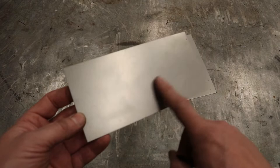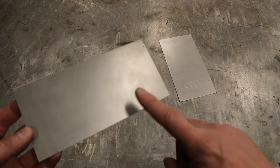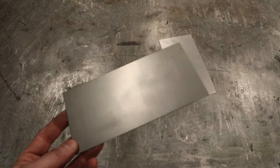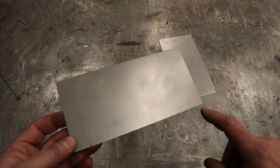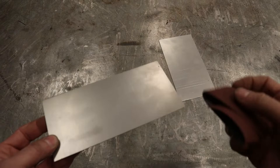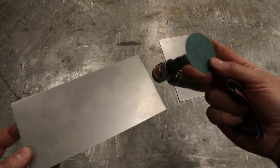The art of taking nice shiny metal and turning it into rusty metal is not an exact science. You're not going to get the perfect shade of color right from one end to the other, and they're not going to match for different pieces, so it has to be a little bit of trial and error. Get yourself some scrap pieces similar to what you're going to rust up and play around. One issue is how clean the metal is — fingerprints, grease, or existing rust will affect the look. Clean it with soap and water and wipe it down dry before you start. The other thing is the actual finish: polished is going to be different than something scuffed up with emery cloth, sandpaper, or a roll-lock disc. You can play around with different patterns and textures to get different results.